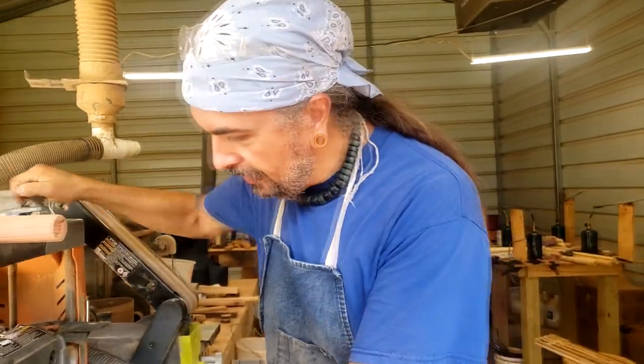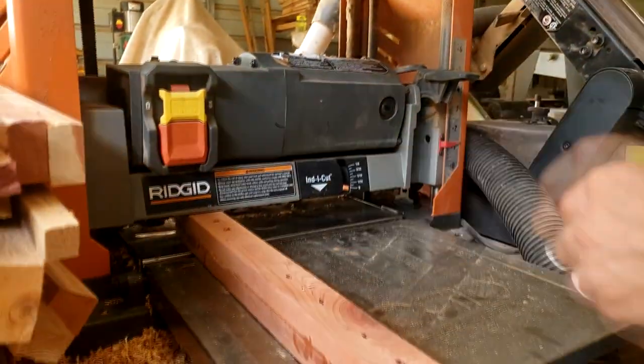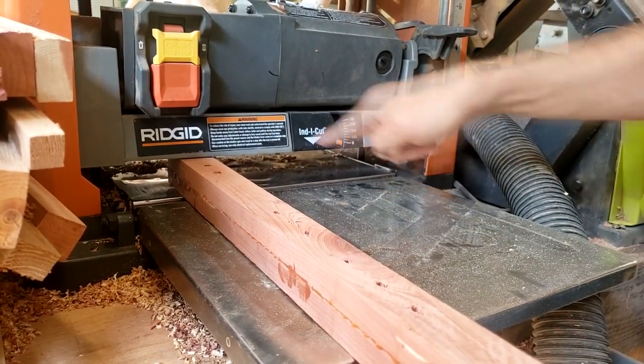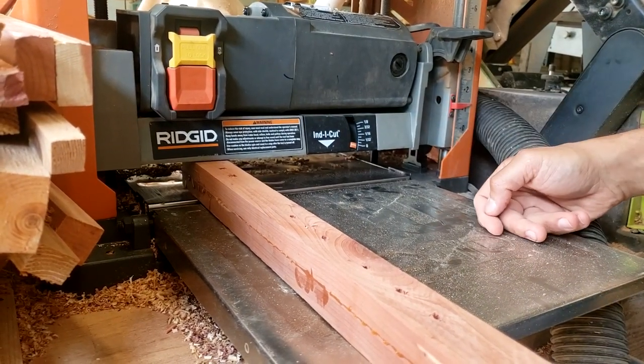I'll show you how I handle that. If you want to watch me on the planer here — I know everybody's planers probably have some kind of quirks about them, and mine is no different. For whatever reason, the bed of this device is a little shallower over here and a little deeper over there, so if I cut it here, I can actually move it down there and cut another millimeter off.